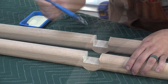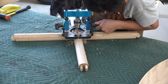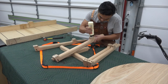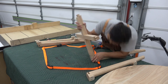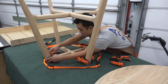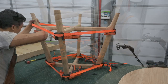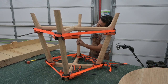I then glue up the base assembly, starting with the cross members. Once the half-lap is glued, I drill a 3/8-inch hole at the center of the joined cross members, drive in a dowel to add extra strength, and flush-cut the excess. For the splayed legs, I apply glue to all the mortises, attach the legs, place the assembly upside down, and use quick-grip trigger clamps at each joint to create a ledge. I place strap clamp brackets on top of the trigger clamps and tighten the strap clamps down — the trigger clamps prevent them from shifting down the splayed legs.